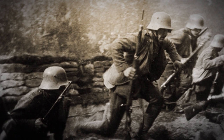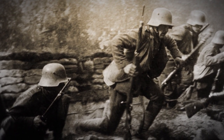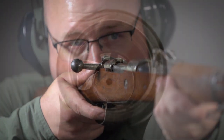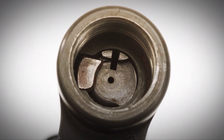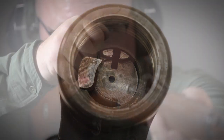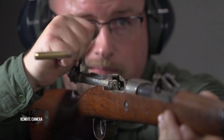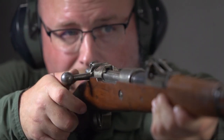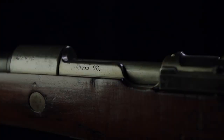This is a rifle that is mostly cocked on opening and fully cocked on closing. It has what we call today the claw extractor. If you look at the right side of a Mauser 98 bolt, you will see that big claw. What that extractor does is grip the cartridge as it is presented from the magazine fully into the chamber — it's called controlled round feed. If you want to know whether it was a good idea, just look at the Model 70 or the Kimber today. Those are features still in use.